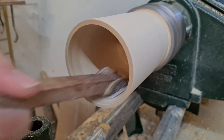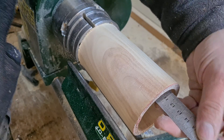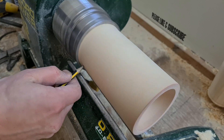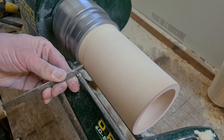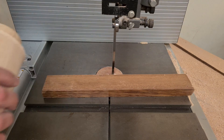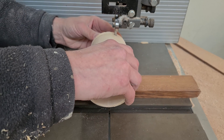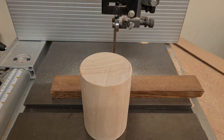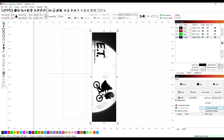Although this video is currently showing a general approach to turning spruce into a hollow cylinder, which was used for the first prototype, I then used an oak piece with a wall thickness of about 4mm. The type of wood will obviously affect the laser cutting process, but for the auto rollers you do need to think about the stability of the cylinder under rotation and also air assist. I think it's about a 5mm thick base to the hollow cylinder.